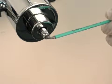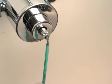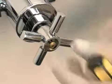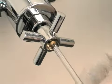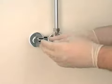Note the Allen key should not go through more than two full turns. Now remove the Allen key, refit the handle with the Phillips screw and decorative cap, and shut the shower off. The shower temperature is now set to your showering requirements.